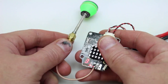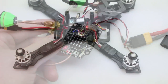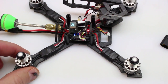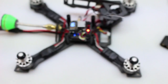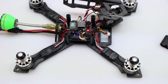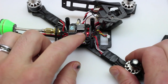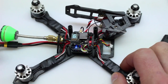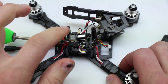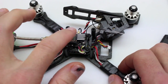We do have a drop, so let's get the ATX-03 tested out because I'm really interested to see what that's going to be. We've had our ATX-03 plugged in for about four minutes. It looks like 70 degrees Celsius — that is an 11-degree decrease, which will help efficiency and help it run smoother. I'm willing to bet that once you get these running and going through the air, the increased surface area of the heat sink is probably going to cool it down a few more degrees than it would without it.